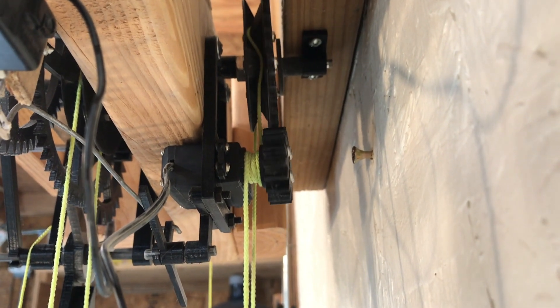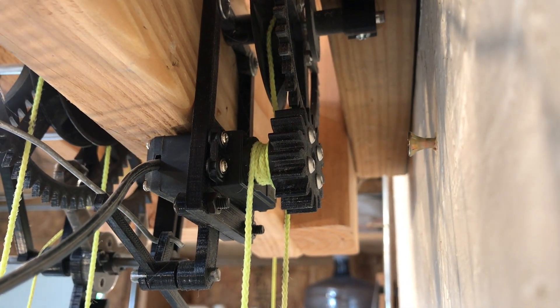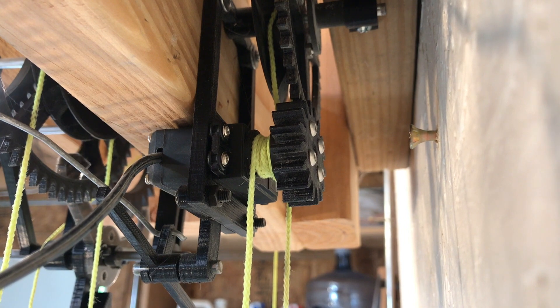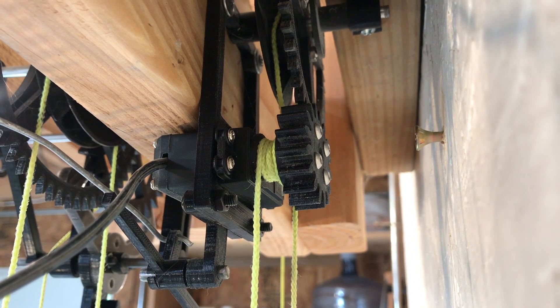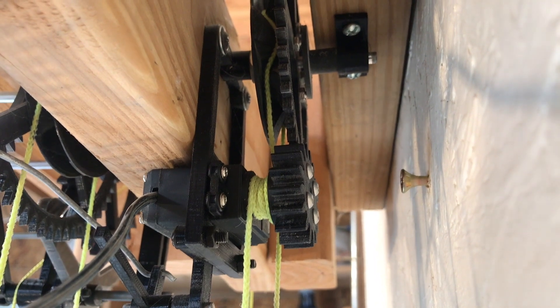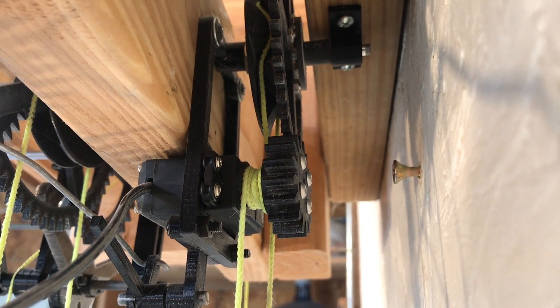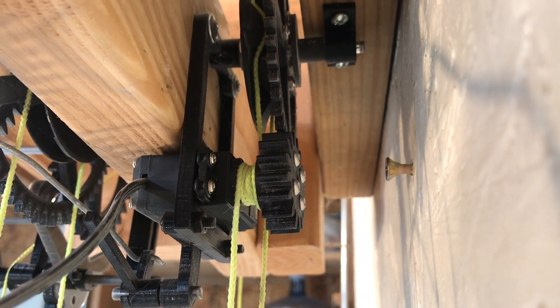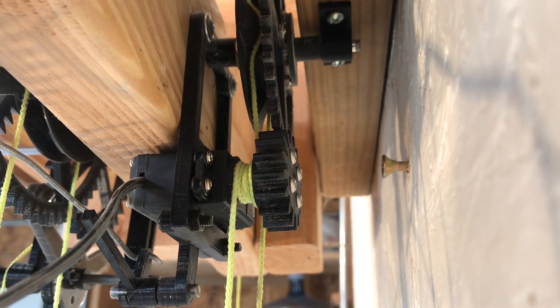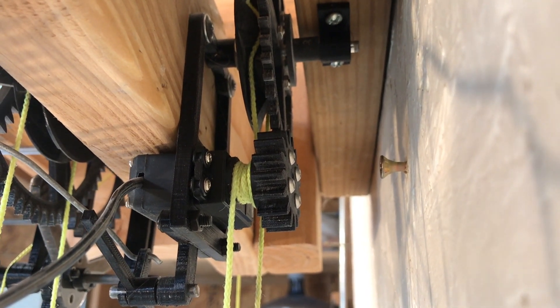Obviously I'm having some trouble here with the winding, but it's fixed up. I've been using an RC servo as the motor for the winding, and that works. I removed the electronics so it's a constant rotation and just wired the two wires directly to the motor, but the bracket is crooked and caught the string. Luckily I'm using a USB phone charger so the current is not too high — the motor just got hot, it didn't burn out. So it's still working, but I need to fix the bracket or design a different one.